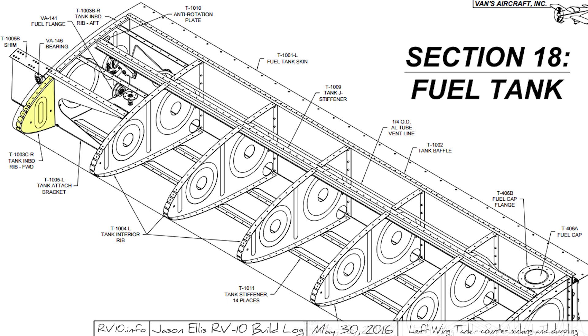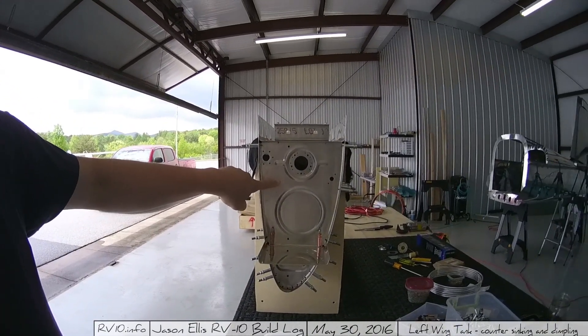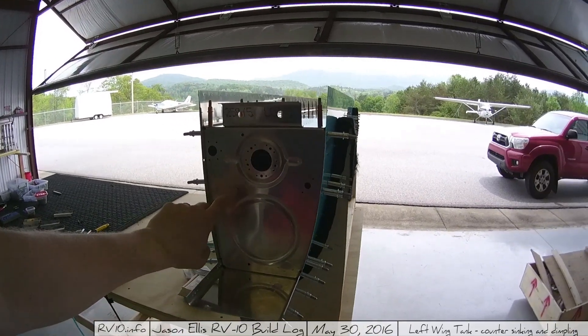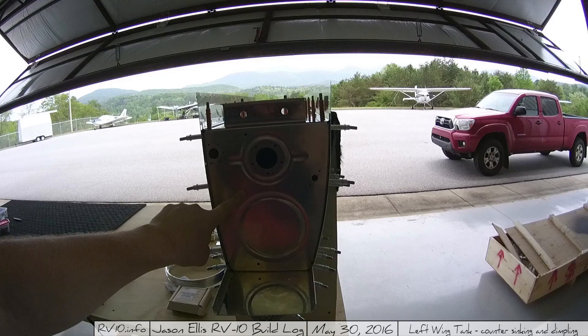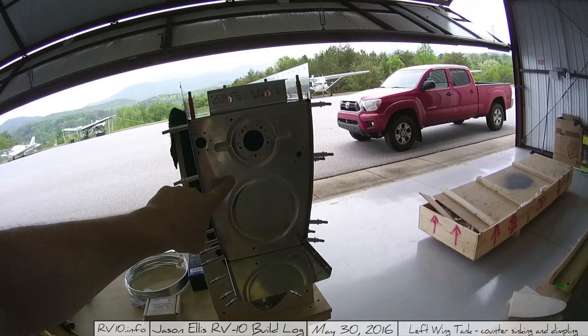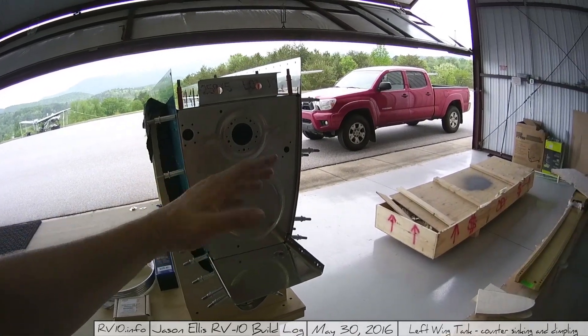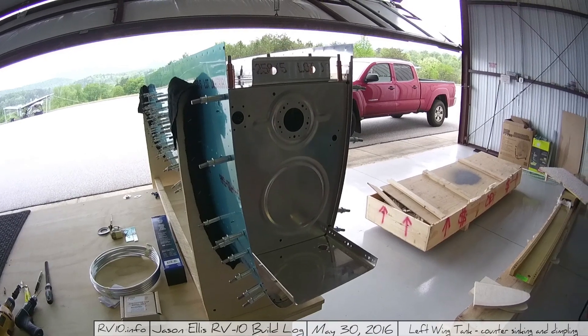Next, in one of my previous videos I talked about how these two pieces right here — it was possible to insert them backwards — and people didn't really believe me or understand what I was referring to. So what I thought I would do, specifically referring to these two pieces on the end of the tank, is actually show you one installed incorrectly. So here you go: you have an L installed on the L tank, but it should actually be the R. You can tell this because you can't see the flange — you gotta flip it around. In this case the diagram was correct, but the actual instructions were not, and there are several cases where things like that happen.